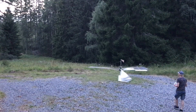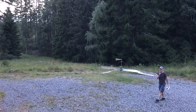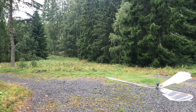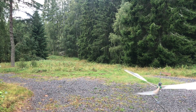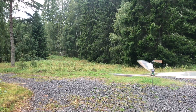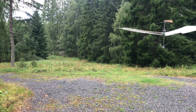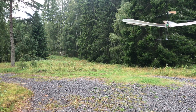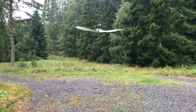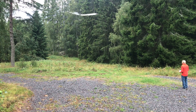And I can't tell you how many times I have been saved by the air cushion — the ground effect. It feels like I will crash, but in the last second it swoops up and saves itself. So that's great. And here you can see a significant dihedral version. I just want to try that out as well to see what it gives. I really thought that I would break the structure when I tension the wires, but to my surprise it actually holds. It's pretty weak aluminum and I have been welding in it so it's even weaker, but there's enough elasticity left to cope with this. Hovering is a breeze, but going laterally is still problematic. Once I get a forward or backward speed, the dissymmetry of lift kicks in and gives the flyback action. The flight controller can manage if you just let the sticks go and give it a bit more power, and it levels out again, but it's still there.